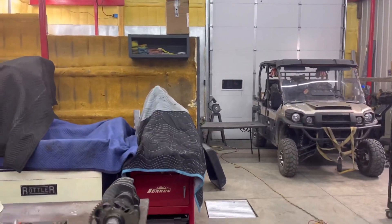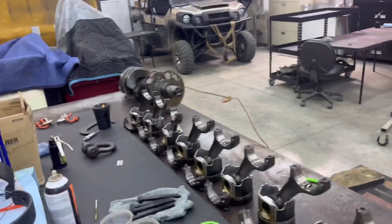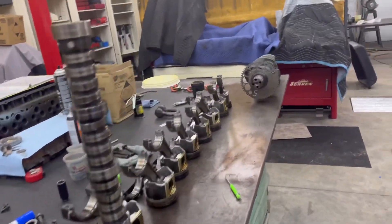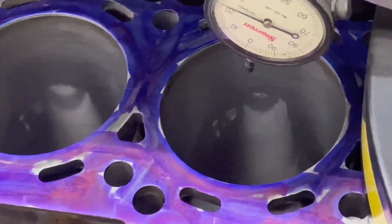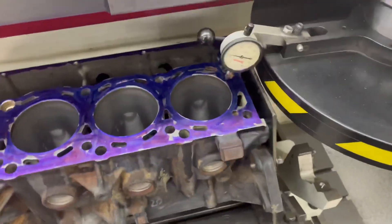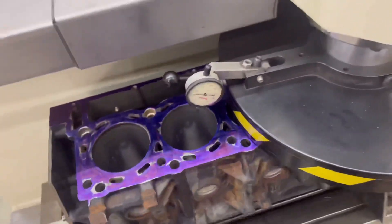Right now we're going to cut the 6.0 and get the 7.3 out, or the 6.4. So we did a 7.3, a 6.0, and a 6.4 - doing it all. We're 2-thousandths up - didn't touch anywhere - we're about to do a block party back there on the 6.4. At 2-thousandths above it didn't touch anywhere, that's pretty freaking good. That's the bonus to running this thing over and over. Let's just drop it down - I was wrong, it was 3-thousandths up on the last one, now I'm 2-thousandths up.